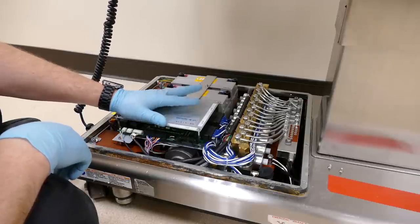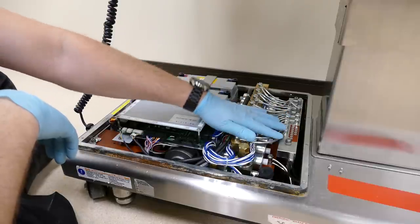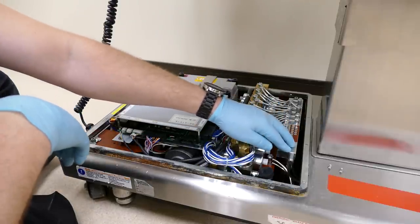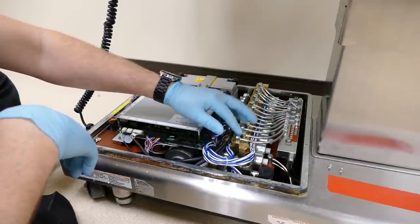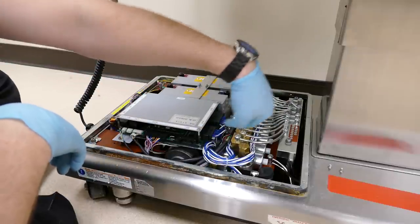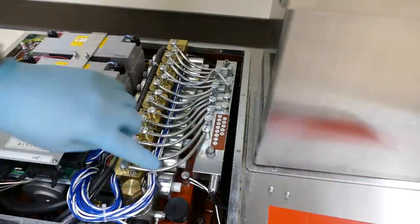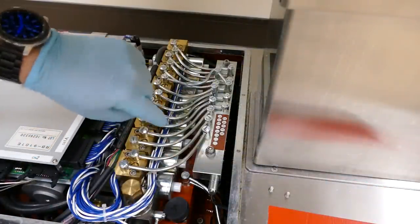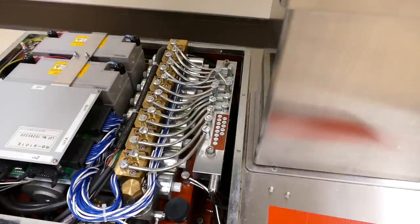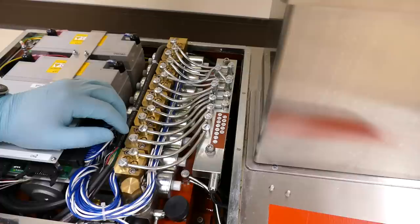Now here you have your main controller board and your battery backup system, and here's your hydraulic system — this is your main manifold. These solenoids each control a separate function. These are bi-directional solenoids, so they'll click this way and then that way, sending pressure to either this line or that line. You can see translucent covers on the ends of each solenoid — that is one way to find out which solenoid controls which function.